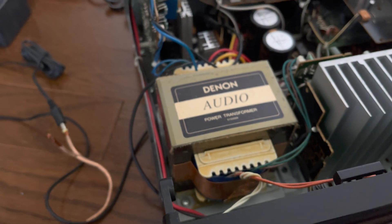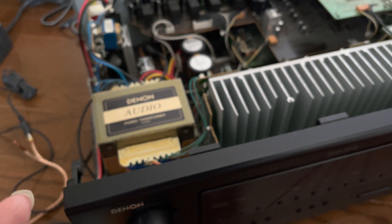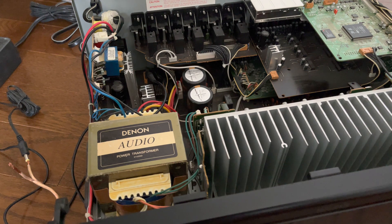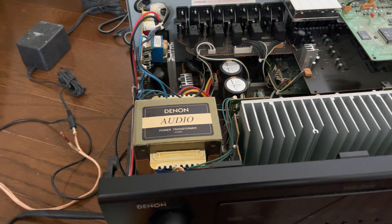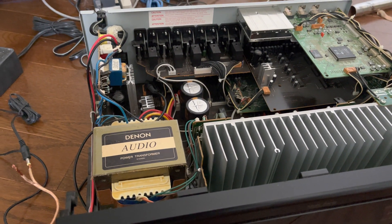I have another way to prove this is the problem. I have a 15 volt external power supply, and I will show you how replacing the 7815 power regulator will resolve the problem — proving it by using an external power supply. I have to stop the video to move the needle back to the very last pin towards the front, in order to show you that if I replace it, it will work, even though I'm not replacing it at the moment.